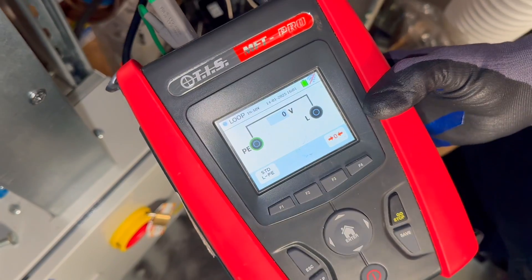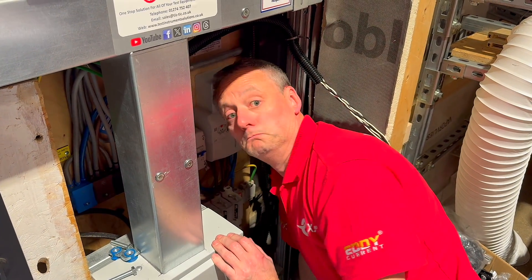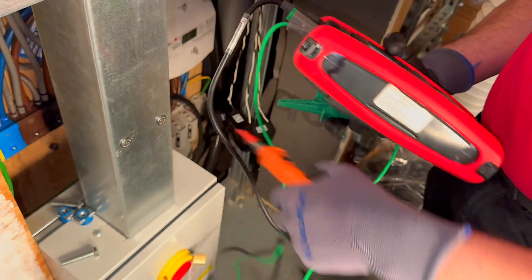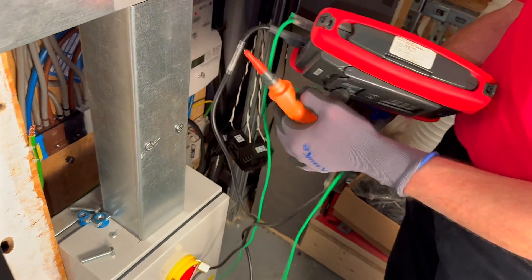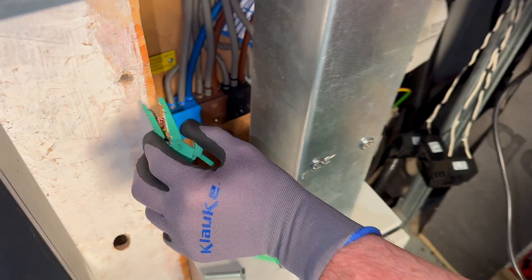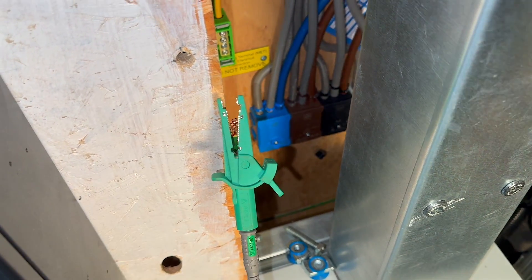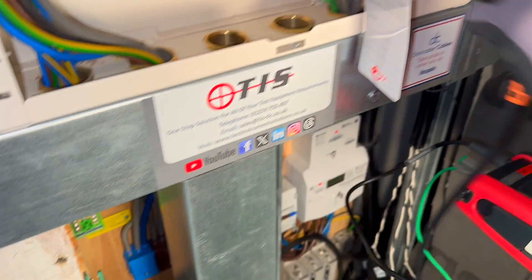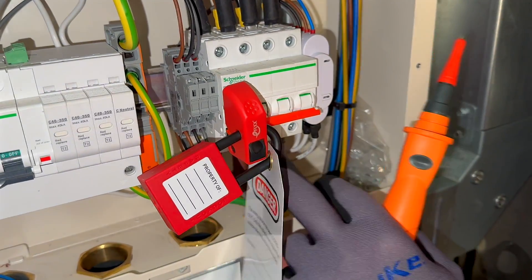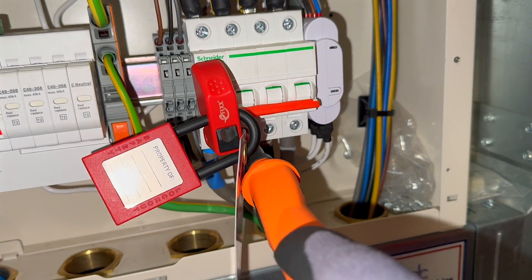We are doing a two-lead test. There's a high current test. If we had any downstream RCDs, which we haven't got in this installation, we could do a three-lead load test. Now we're going to probe on in the safest possible manner. Our crocodile clip first of all is going to go around our earthing conductor and make a nice electrical connection — give it a little squeeze to confirm it's on nice and tight. Then we're going to probe onto the live part of the installation. The outgoing side was dead, so we're going to probe onto the line connections underneath, starting with the brown line conductor.